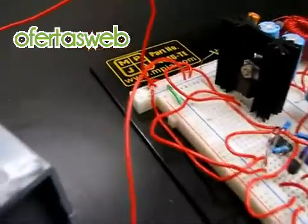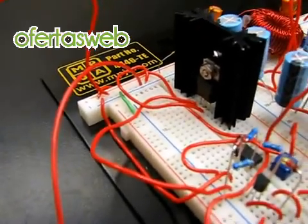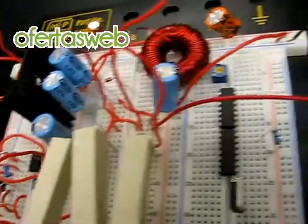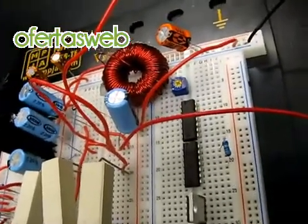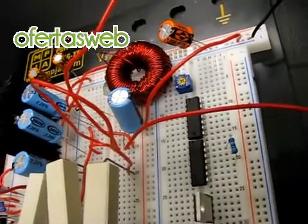This is a 12 volt to 48 volt DC to DC converter which I built out of mostly discrete components. You can see a view of my board here. I have a TIP120 TO220 package transistor with heatsink. Behind it are a couple of filtering capacitors for the output and the heart of the system: a very large inductor which I salvaged from a power supply.